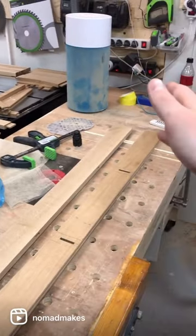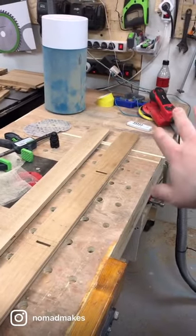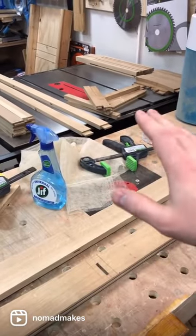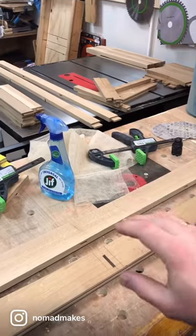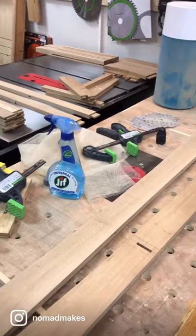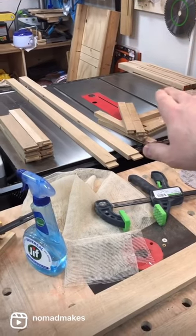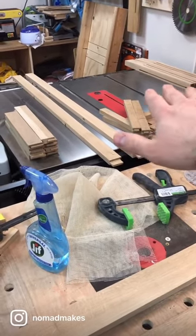And I mean, it's not the sanding itself that takes time because the Chinese sander I got there is really good. This project has been going on for so long that the parts have moved a little bit and lining them up and stuff takes a long time. Anyway, I got the legs sanded. They are done, sanded to 120, and I raised the grain on them and sanded again.